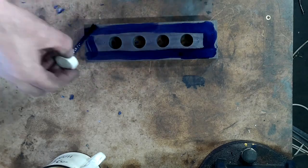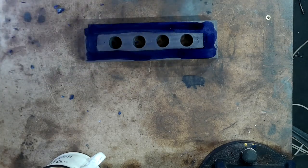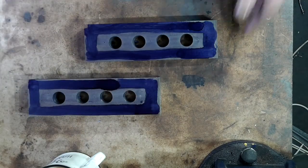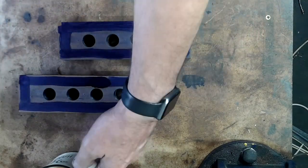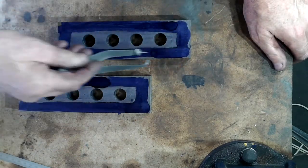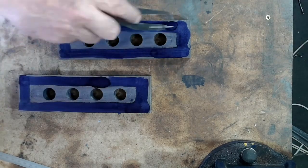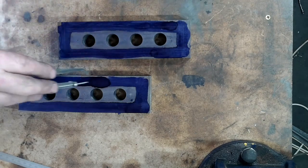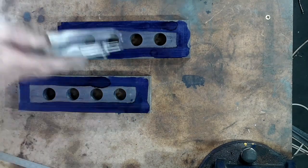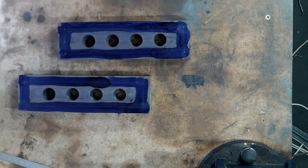With the drilling complete it's time to mark out the recess area. The idea is to leave a face around the outside edge, so I decided on 10mm as a suitable size and went for it. The ends of both parallels aren't going to do anything so I'm not going to machine them beyond dressing each end with my belt sander. To aid this stage of the marking out I'm using a pair of odd leg scribes set to 10mm. I'm using the dot punch to highlight the lines for setting purposes.